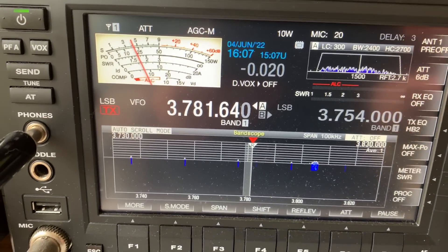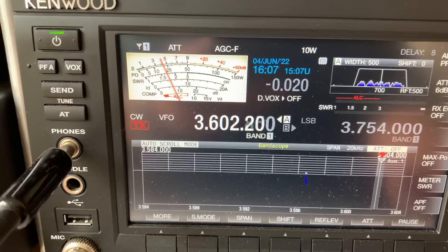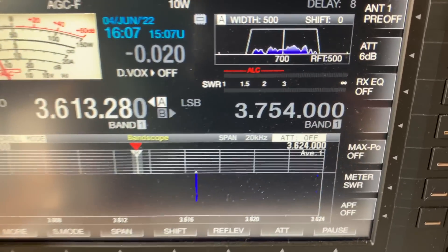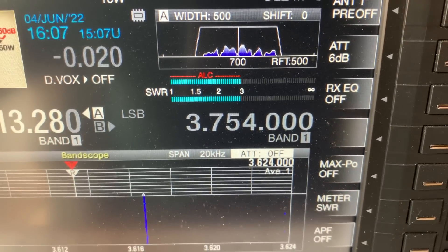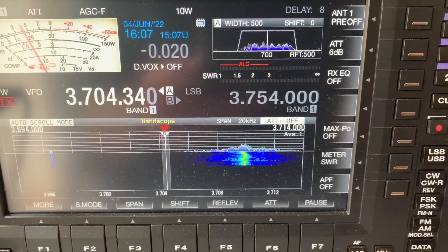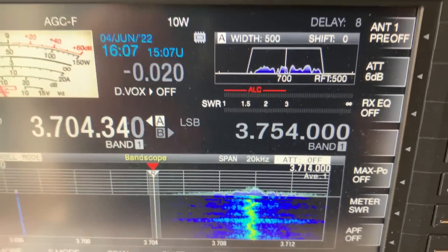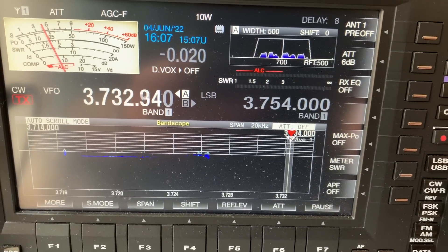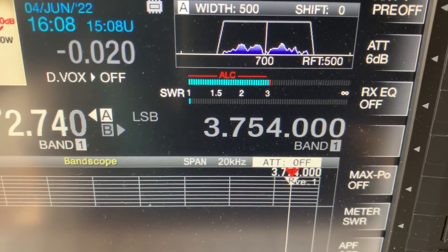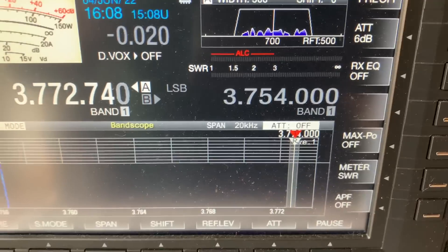Let's go to 80 meters. I'll put it on CW and get to the bottom of the band — at least for voice, around 3.600. We're quite high, we're in three. Winding up the band to about 3.700, it's below 1.5, though waving a little bit — there's obviously some wind out there. At the top end it's perfect for the voice band, which is what we want.